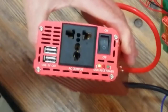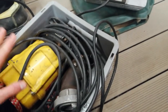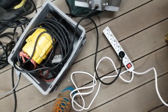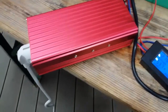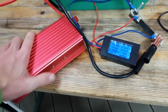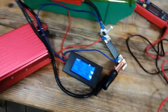I found an interesting load — this pump from the fire department, the smallest one we have, rated at 400 watts. I also found a really old light, I guess it's 1000 watts, and of course a heater. With the pump connected and running, we pull 240 watts and 17 amps at start. After a moment, everything stays warm — quite okay for around 200 watts, nothing happened.